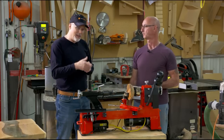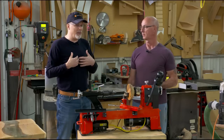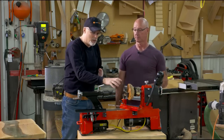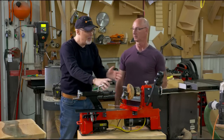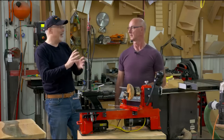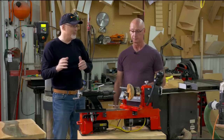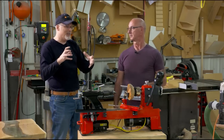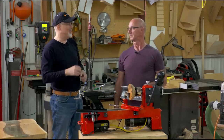There's also the ability — I use a vacuum chuck a lot — and this gives you the ability to spin it around, use the chuck on this end, and slide that into the vacuum chuck perfectly centered. That is impossible to do otherwise, so you're transferring it over and the vacuum chuck is holding it, but it's giving you perfect centricity as you do that.